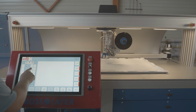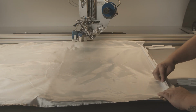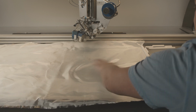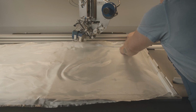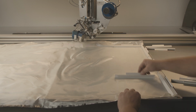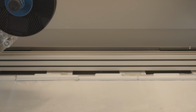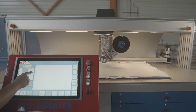The tape laying frame can be moved along X and Y axes. Easily exchangeable frames made of aluminium profiles serve as the laying area for the tapes, into which a glass fiber cloth is clamped as a temporary or permanent carrier material for the tape laying by means of clamping bars. These frames are plugged into the mountings on the movable work surface on the XY traverse and held magnetically.